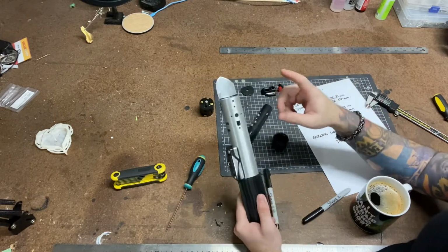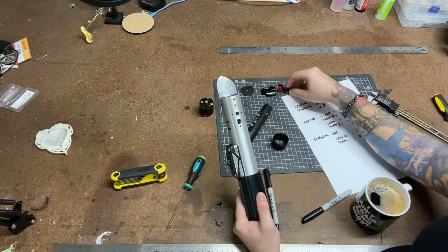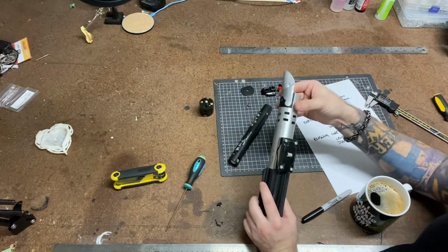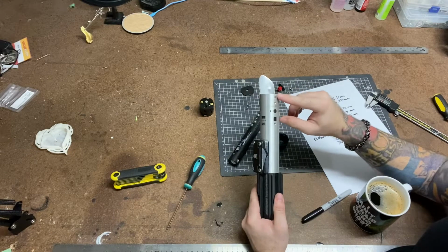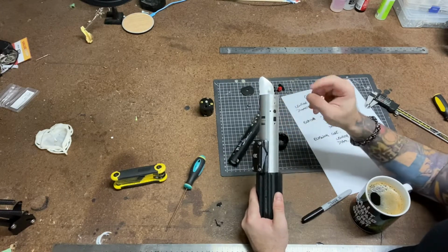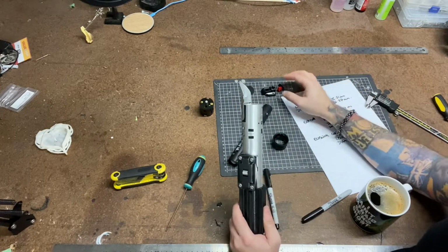One of the really nice things is we do have a bunch of holes up on top here from various screws and accoutrements, so I can use those to secure my socket in place, and I've got a couple of areas that I can sink a tapped hole through, and then a thumb screw as a blade retention, so awesome, that'll be really good.